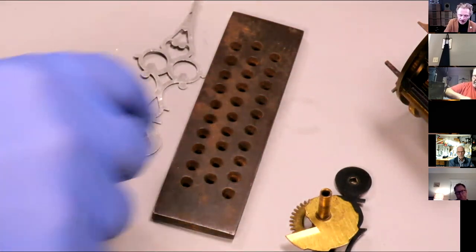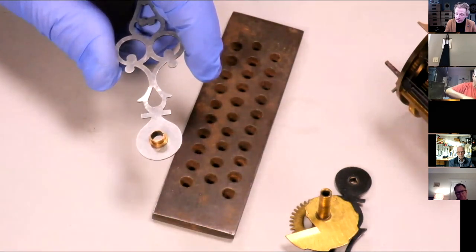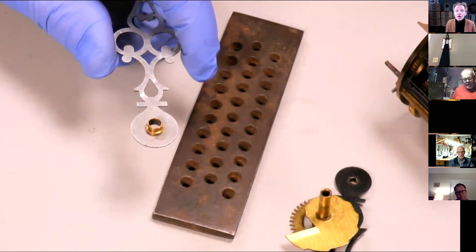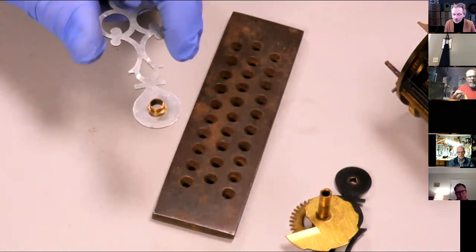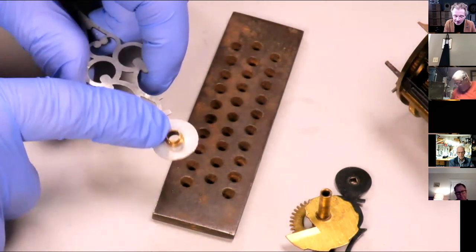I think what you'll find is anything that involves squeezing it with pliers or a center punch in it or something is basically never going to work in the longer term. It might get the clock out of the door, but in a few months, your client will ring up and say that the clock stopped because their hands are touching or something. So I think that's quite problematic.